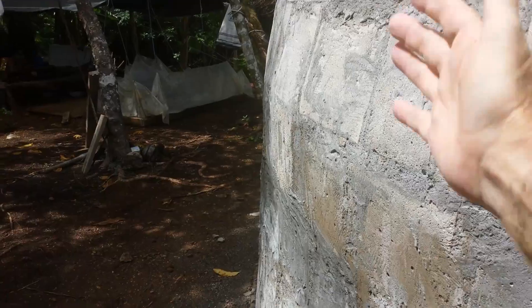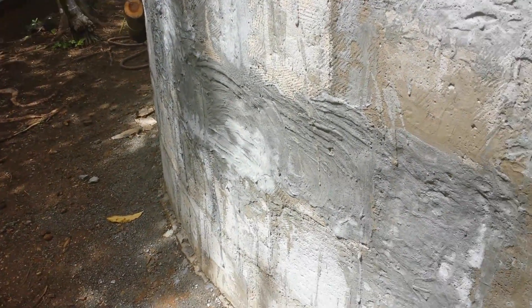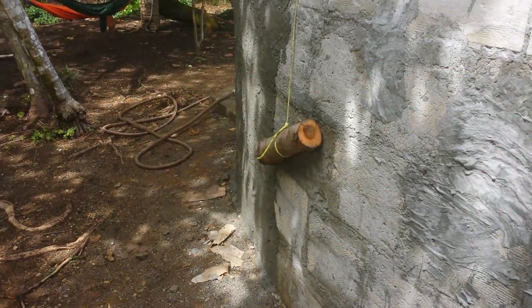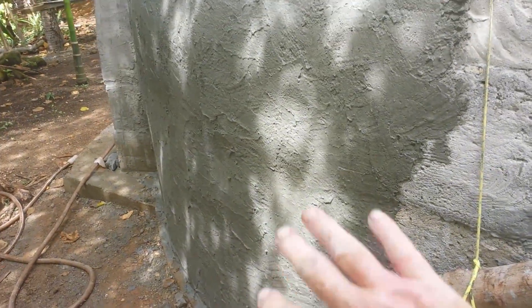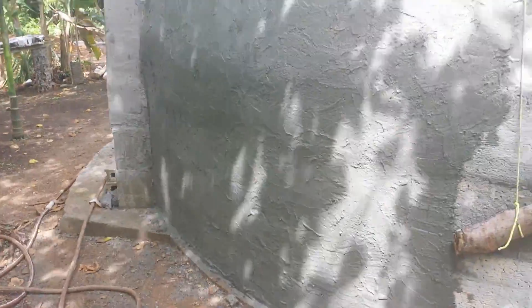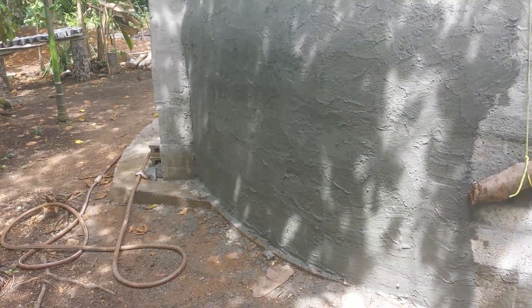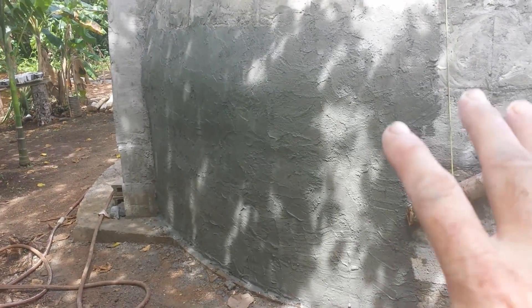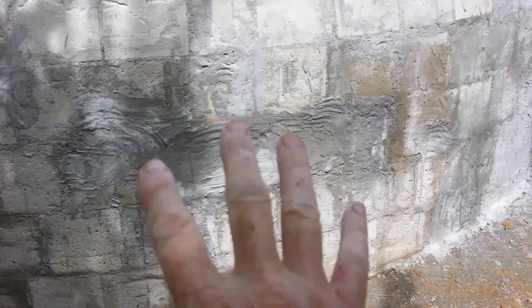I've sanded and rough sanded the edge of the dome. I filled in some of the aircrete blocks that got some big holes in them. The first step after that is to go ahead and aircrete the wall with some foamed concrete. Then you can do a little more sanding to get it just a little bit smoother in preparation for the fabric screening for structural strength. I'm getting ready to do this wall here next today with the fabric screening we have here in Island, using it for strengthening this wall.